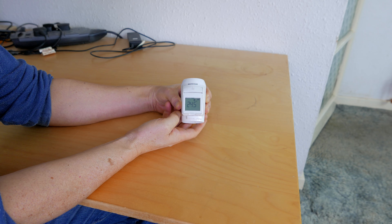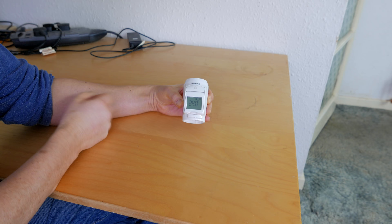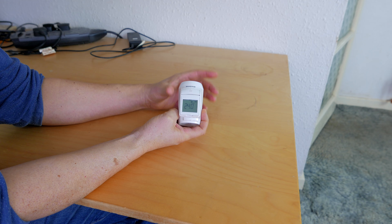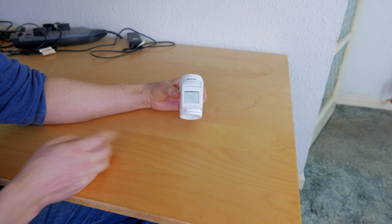Place it on the valve body. By default it shows the set temperature, but I have mine set to show the current room temperature. Turn the top dial once and it tells you the set temperature — currently set to 18 degrees. If I want that room to hold 23 degrees, I turn it again to dial up to 23. It then goes back to showing the room temperature, and will now hold 23 degrees — keeping the valve open until it gets near that temperature, then slowly closing it. Turn it once to confirm and it says it's set to 23. It's as simple as that.